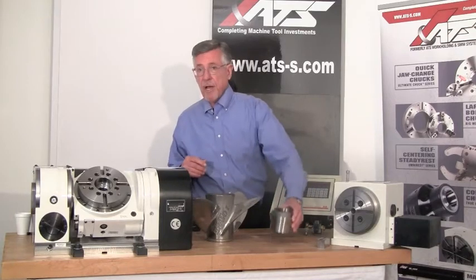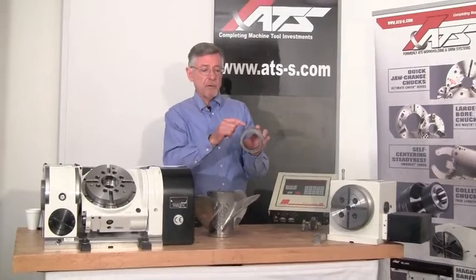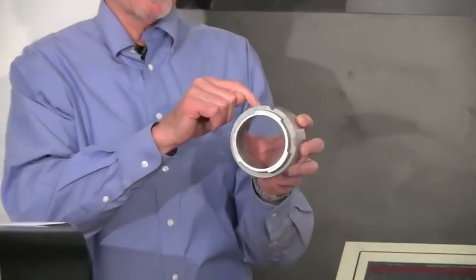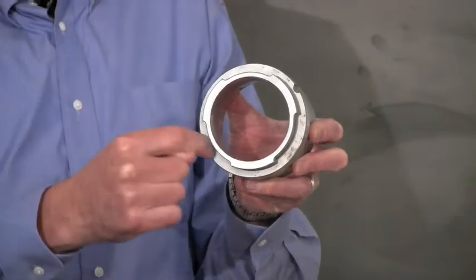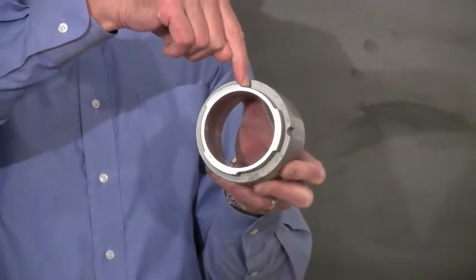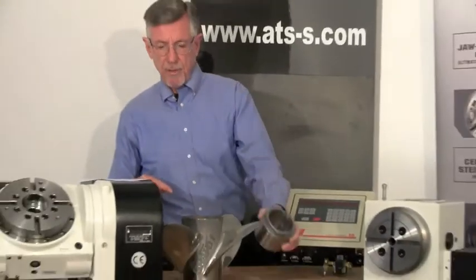Secondly, these can be quite complicated parts. This part came off of a lathe. They first have to orient this way to cut a slot here. Then there are 144 small slots every 2.5 degrees around the perimeter. Finally, we need to do these three cutouts — plunge in a tool, rotary cut, pull out, move over — the same thing three times. It can be a very complicated part.